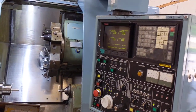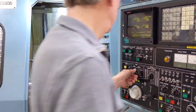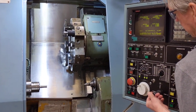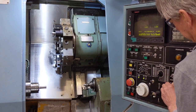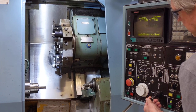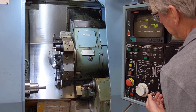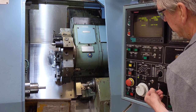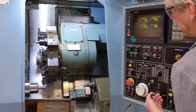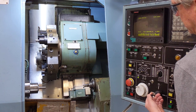The next thing I want to do is just move it around on the rapid a little bit. We're going to come over on the Z — let me slow that down slightly — and then come down on the X without hitting the spindle. Come up a little bit again, come over, come down a bit, and back up, back over.